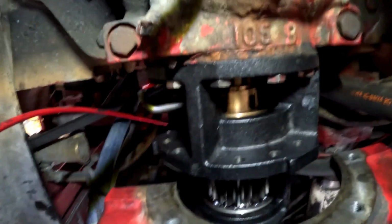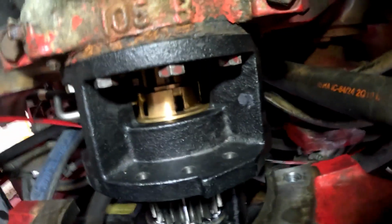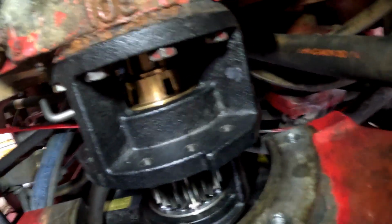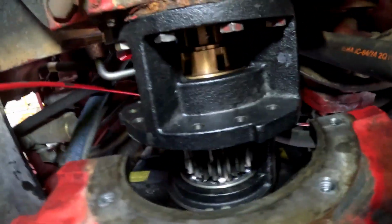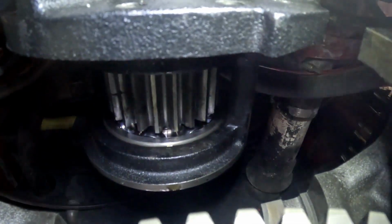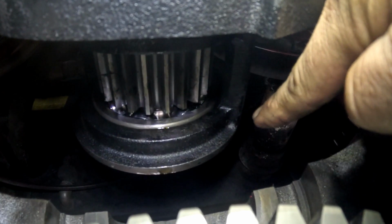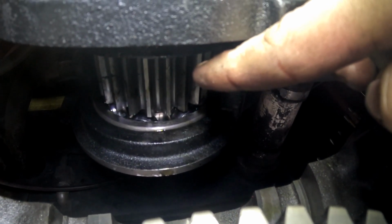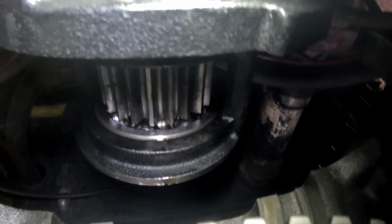Okay guys, so this is what happened. I had my bearing assembly here 180 degrees off. So now my adjustment pin is going to be down on the bottom, which I don't think should be a problem. It'd be easier to access. All I'm thinking is why they would put it up top is if ever the spring was to break out of it, then gravity would keep it down inside the cage. But I just tested this and it seems to be working. So what ended up happening was this brace, I guess, what it holds the bearing in place, was actually down about right here, and the transmission still went up in there, but it wouldn't rotate anymore.